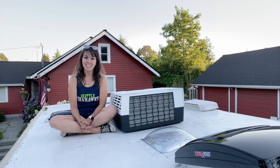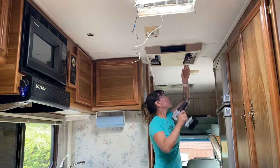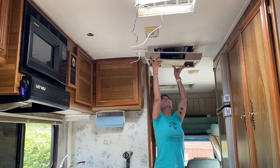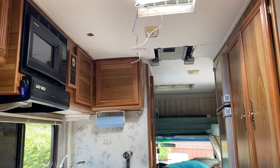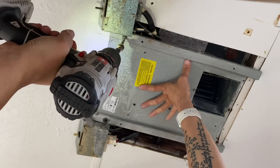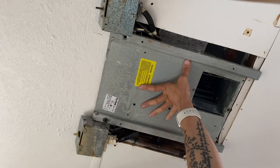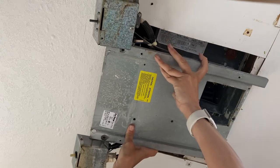The first step is to remove the control box from inside the RV, which is simply taking a few screws out and removing the cover. The air conditioner literally just sits on top of the roof and gets sandwiched onto the roof from below. Once the cover is removed, you have to remove the control box, which is held in by very long screws — I'd recommend using a drill to take them out. With any electrical work, make sure the RV is unplugged, the breaker switches are turned off, and all electrical components are off before proceeding, especially when cutting existing wires.